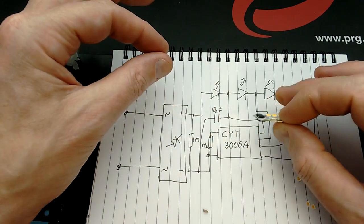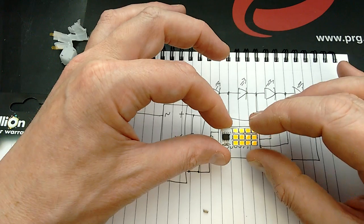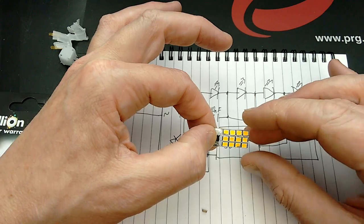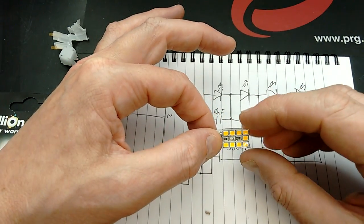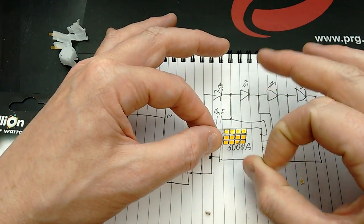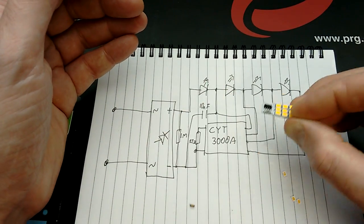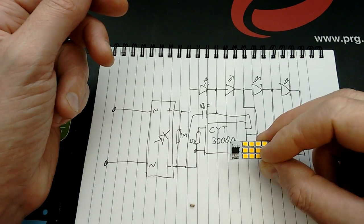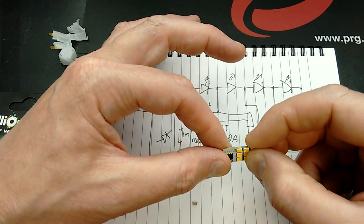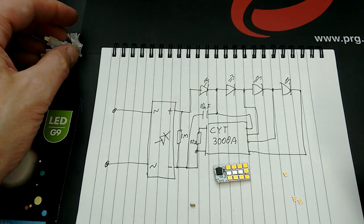Very simple circuitry; it will get warm, as you'd expect in such a small package. I've not had much joy with these - goodness knows whether previous ones were clones or the real thing - but the chips had gone faulty, short-circuiting the output and blowing the LEDs very quickly. When I shunted LEDs in those other lights, as soon as power went on, another LED just went splat. It seems to be a problem with that style of chip, though it's still early days. It's a neat, simple arrangement with LEDs on both sides, though I'm guessing it would be quite flickery. It was worth opening up, a bit of a shame it burst in the process.